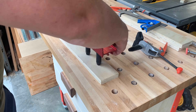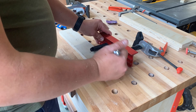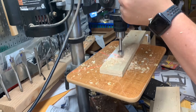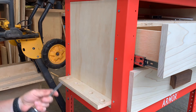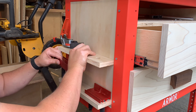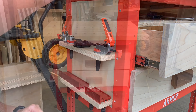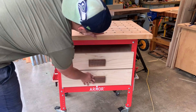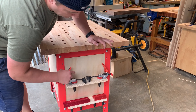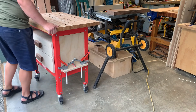Don't be intimidated by making drawers — it's really straightforward. Just get some plywood, cut it down to size, add pocket holes, and you're good to go. I'm using the Armor Tool inline clamps right on the bench — works great. Add pocket holes in the front and back, wood glue, half-inch plywood for the bottom, and some brad nails. For the glue squeeze-out, pull out a plastic straw — it contours into the angle, picks up the glue. It's a great trick I use often.